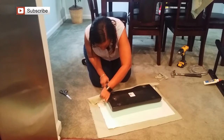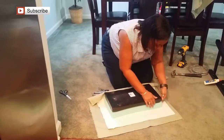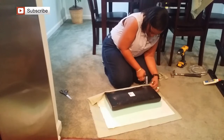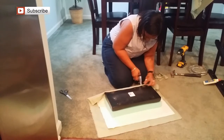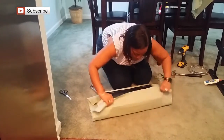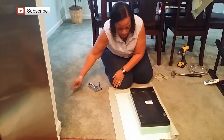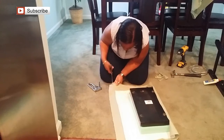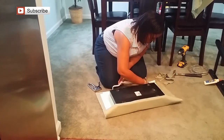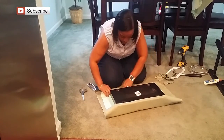That'll give it a nice finish on the bottom side of the chair. We're just going to do a couple of anchor staples here and come along later to tighten the fabric down and put in the remaining staples. We'll do this on this side, then turn it around and do the exact same thing on the other side, cutting off any excess. You may have to cut the batting too, just to make sure you don't have too much fabric.